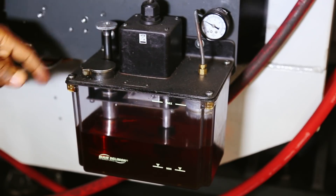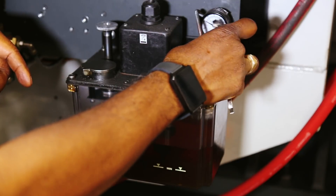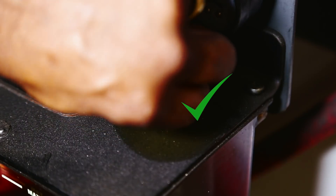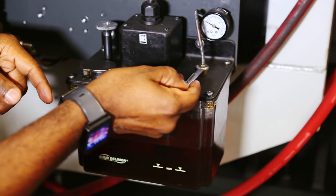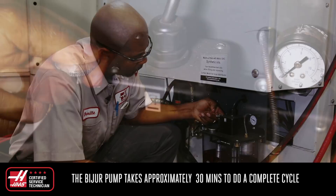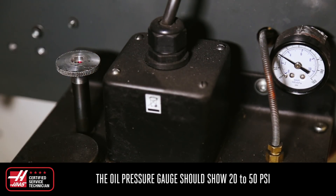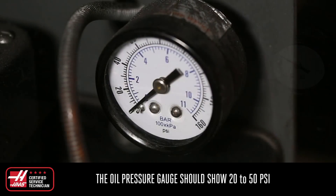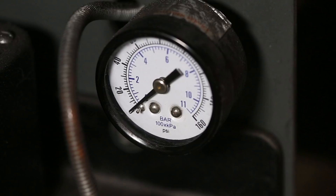When that is complete, disconnect the oil feed line from the fitting above the canister filter and pull up on the plunger. Oil should come out of the fitting when the plunger is operating correctly. Reconnect the fitting with the spindle running at 5 rpm and observe the pump operation. The pump takes about 30 minutes to do a complete cycle. When the plunger drops, the oil pressure gauge should show a minimum of 20 psi and can go up to 50 psi, then gradually decrease to zero in 3 to 10 minutes. If the pressure drops in less than 3 minutes, there may be a leak in the system.